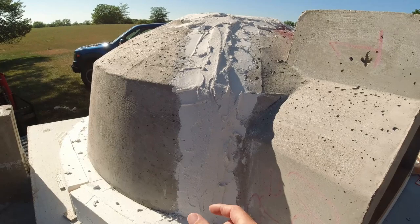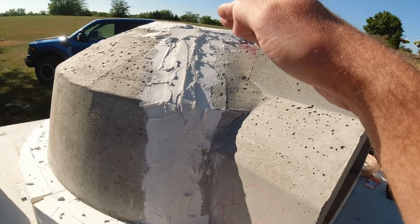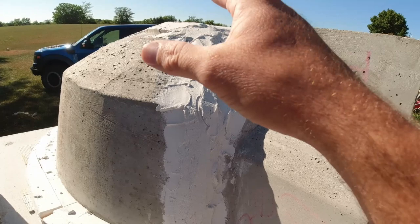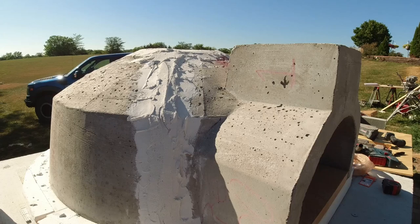What I noticed was I had a fatter crack at the bottom, and as it got to the top, the crack thinned or got more narrow. That was because all the pieces were slightly laying in. So if you have a tighter seam, a smaller gap at the top than at the bottom, most likely your whole oven is leaning into the middle, which probably isn't a terribly big deal, but it's just something to check. Mine is actually leaning in just ever so slightly, but again, not a big deal. Not gonna worry about it.